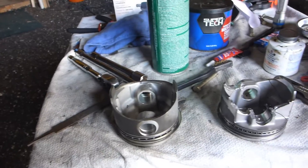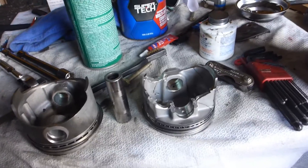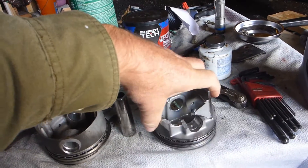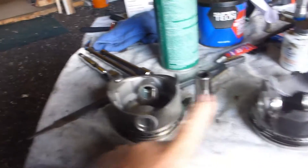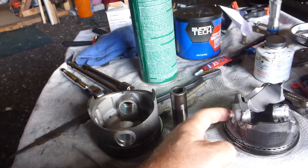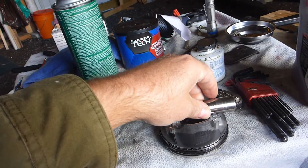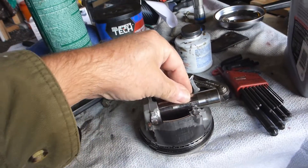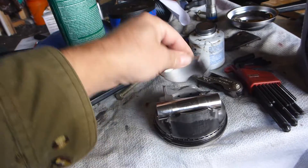I had a friend over and we were talking. He said he'd used those nylon spacers — those nylon inserts — and they work great. As we're going through that conversation, it got stuck in my head, and like a complete dumbass I thought I'd just use those nylon inserts here. But this piston doesn't rest against the cylinder wall like the old ones did, so those nylon inserts vibrated loose. Over time they got worn until they finally fell out. The wrist pin then migrated over, got out of there, extended past the cylinder wall, stressed against it, finally broke, and the engine quit in a hurry.